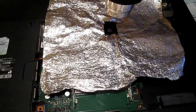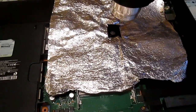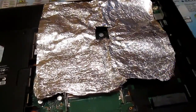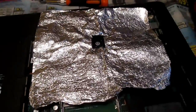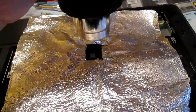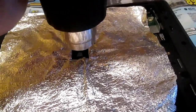Once you have preheated the chip enough, all you have to do is keep the temperature and check the time. It is very helpful to sometimes check the smell — if you are heating too much, you could damage the plastics and you wouldn't be able to reinsert some components such as the battery back into the PC.